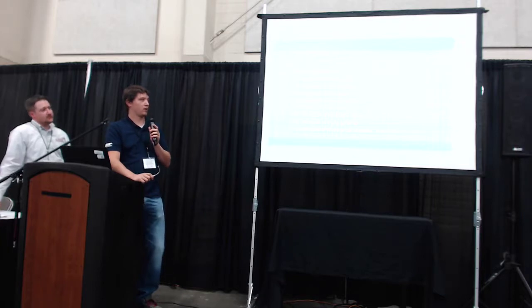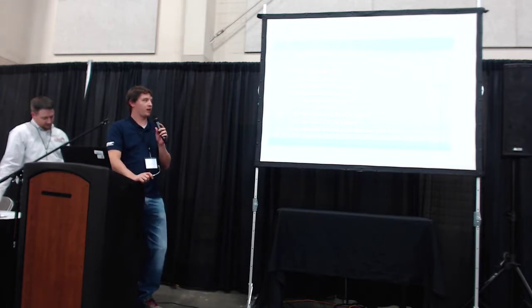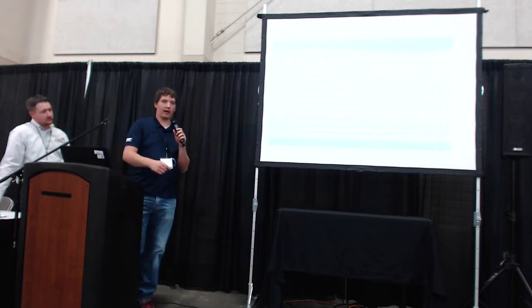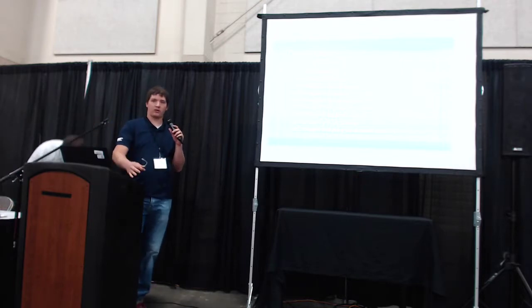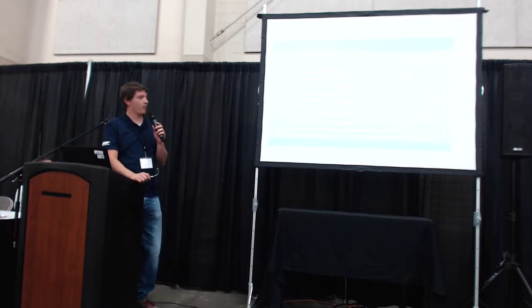Documentation of weather. If there's a chance of rain, make sure you document it. Document the ambient temperature, that sort of thing, on the weather. Documentation of the pavement locations and quantity. So rather than just on the tickets, it's good to have a backup of saying in your diary they paved from a certain station to a certain station, and at the end of the day, the ticket's quantified to 2,000 tons or whatever it did. So that way there's another location that information is found rather than just on the tickets.